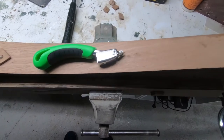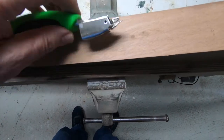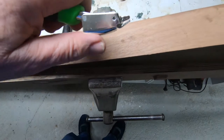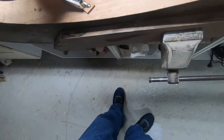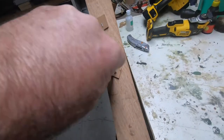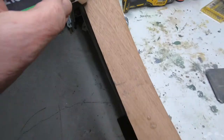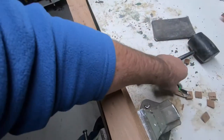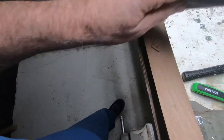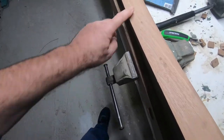Here's a very interesting little tool I bought — I put it into Google as a staple remover and this is what you get. It's got a little tooth on the front and you hook it underneath, and when you rotate it, it closes that tooth and grips the staple. You work it underneath and then pull it up. Then to pull the whole thing out I just get a screwdriver and hook it up.